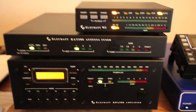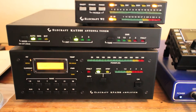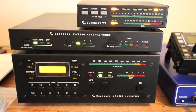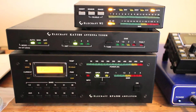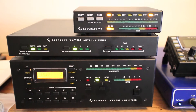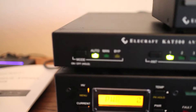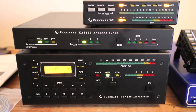So I'm going to hit tune and record what happens. It does pass through the key line to the amp. The amp actually freaks out because it's not matched and the KAT is not cutting the key line. It throws the KPA into a fault, which obviously defeats the whole purpose of automatic tuning. My goal is to put this in a remote location and be able to rely on the KAT in auto to properly find a match and keep the KPA safe at all times.